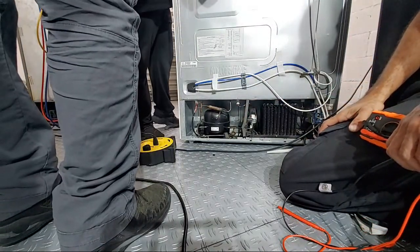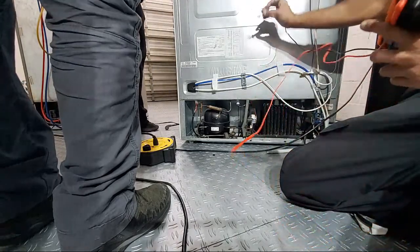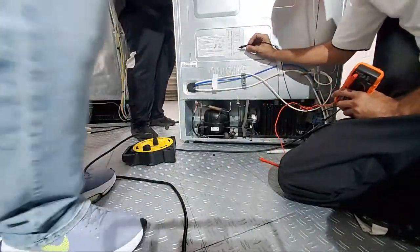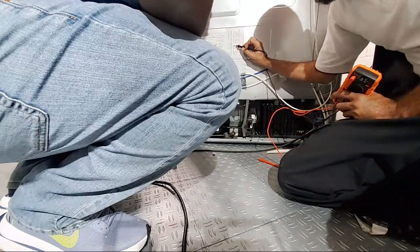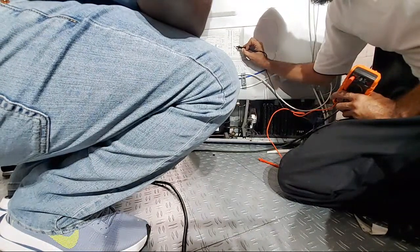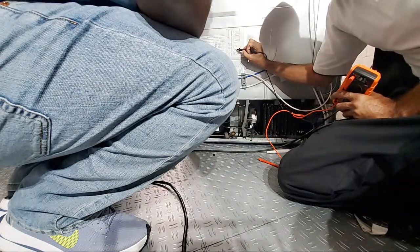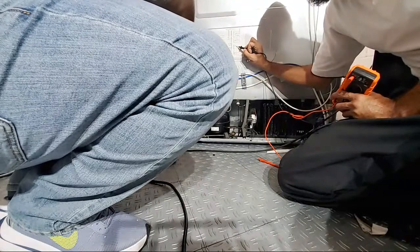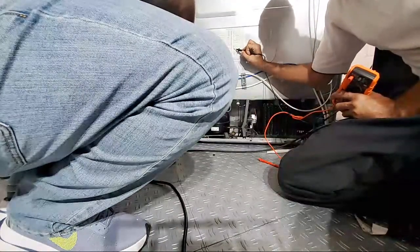You see that CN75? Y'all found CN75? Let me show you. Here's your condenser fan and here's your schematic. It's going to be a plug. Again, you can see CN75, pin 2 comes down to ground, and also pin 2 to pin 10. Why? Because right here's your fan, that's the wire, the black, red, and gray. So you look for a plug that has at least those on.